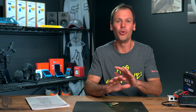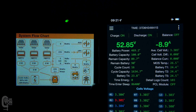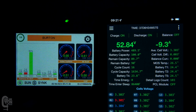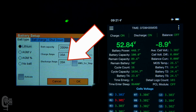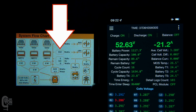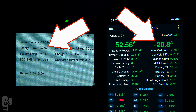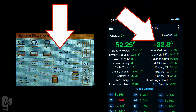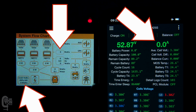But what happens if there is no grid power or no solar power available, and the inverter's limit or the BMS limit is reached? The battery is powering the entire load at around 500 watts, with no solar and no grid power. The inverter's maximum discharge amps is set to 20 amps, which is lower than the 38 amp BMS limit. I add 600 watts of load taking us right up to the 20 amp limit, then another 600 watts, and the battery current has jumped to 33 amps. The fault alarm sounds, the inverter trips, and everything goes to zero — showing F14 DC overcurrent fault, which is to be expected.